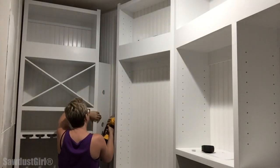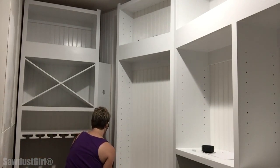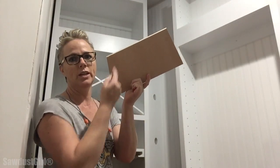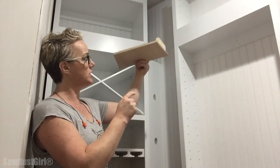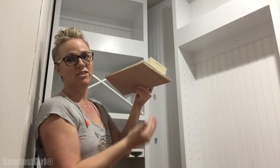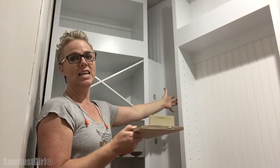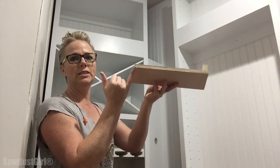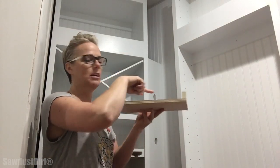Securing this thing into place was a little bit tricky. I had to put a cleat on the wall behind it so I'd have something to nail it to, and then I used a lot of caulk. I cut a piece of wood to match all of the weird angles, and I'm securing a block of wood on top so I have a way to secure it to the adjacent cabinet side, since there's nothing actually underneath it. It will look like the cabinet side is behind this shared face frame, and then it will sit on the wine rack on the other side and I'll nail it in there.